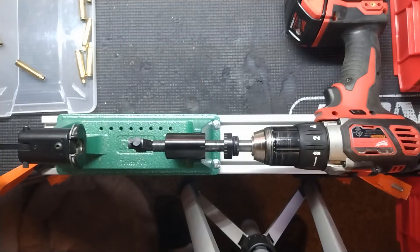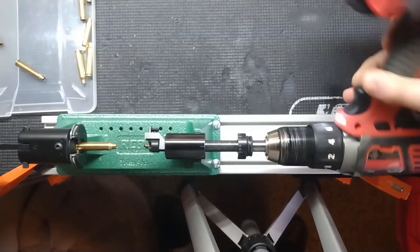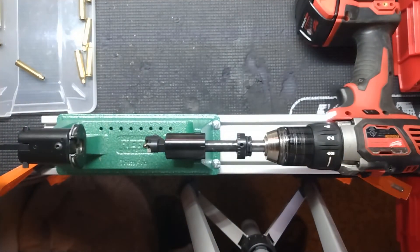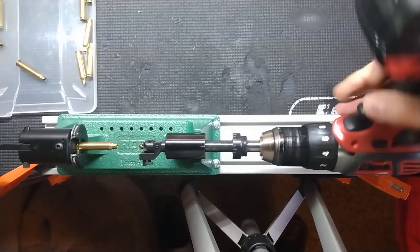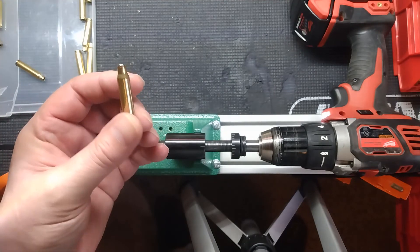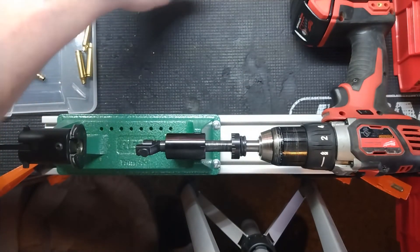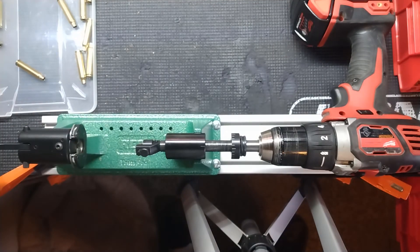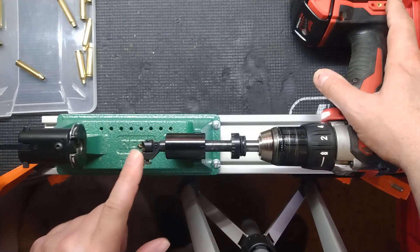That's the last portion of the video. I thought the previous two sections may help somebody who doesn't have this setup or is using a different method, but for me this will be the final trimming method I'll use from now on. It's very easy on the hands, doesn't take a lot of effort — drop one in, let it float, bring the pilot head up, a few seconds with the drill motor and you have a perfectly trimmed 223 case. Once done and measurements are checked, these go back into the wet tumbler to clean off the lube and any shavings, and then they're ready to load. If you have any questions leave them in the comments, and I'll put the link to the cutter head setup video in the description.